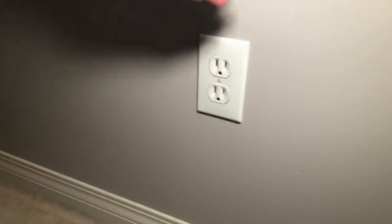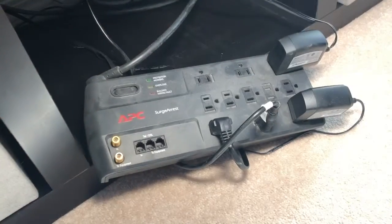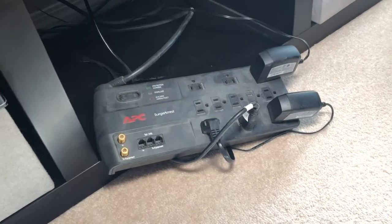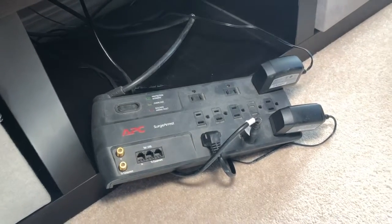Now let's talk about electrical outlets. Your examination of outlets will be mostly visual. As you pass through a room, see how many outlets there are. Are there multiple extension cords with many devices plugged into them? This could be an indication that the number of outlets is inadequate for the current homeowner's needs and perhaps inadequate for your needs.